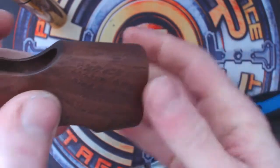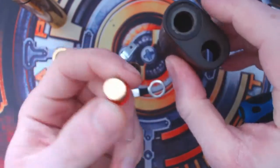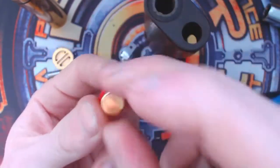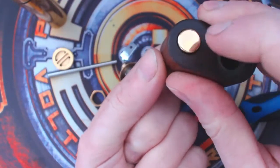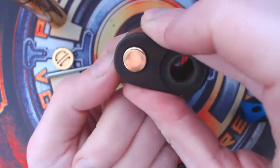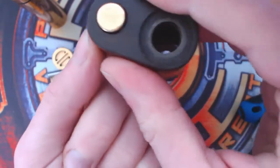Take the nut out, then you can take the 510 and the washer out. Turn it upside down and the button and top contact come out. If you want to change the button for one of our walnut or other buttons, pop your new button in — all buttons are based on a 12mm diameter, but wood is natural and can vary. If the new button is a little bit tight, you can sand it out carefully to give a little more clearance.